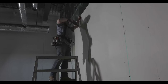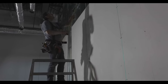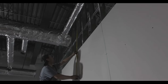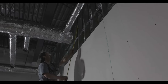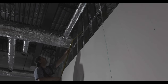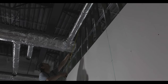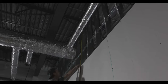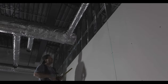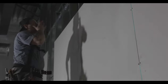We're using phosphate screws, and this is a six-inch, light-gauge 25-gauge stud. When you're up there doing your screwing off at the tops, always measure your tops — measure both sides of the sheet because they might be slightly different. It could be a quarter inch to an eighth inch different side by side, so check both in case you need to angle-cut them. There's usually always one direction in a building where you've got to angle-cut things — usually back to front.